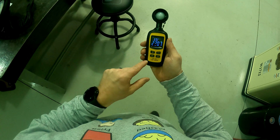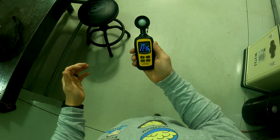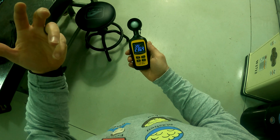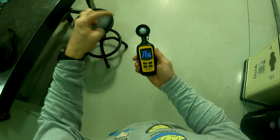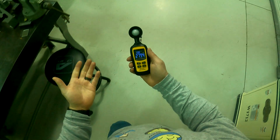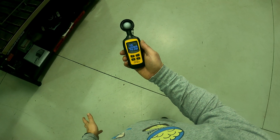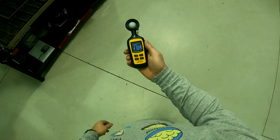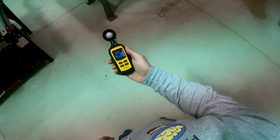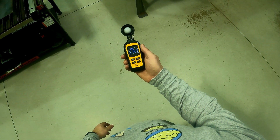Here's the light meter — this measures lux, which is how many lumens are in one square meter. This will be a much lower number than the total lumen output of the light, because it's measuring just a single area. Right now I'm about 280 lux. Going underneath the lights I'm going to replace, I'm about 400 to 410 lux. Between the two I'm going to replace, I'm a little bit higher — around 520, give or take.